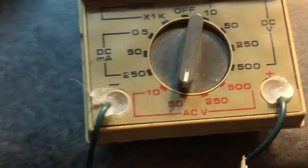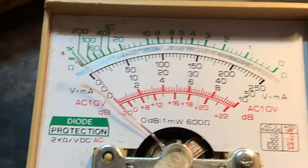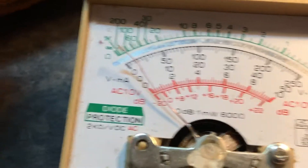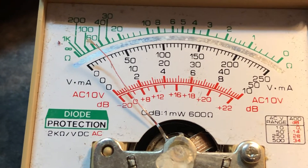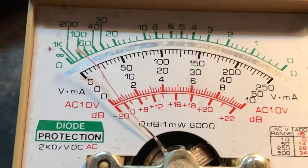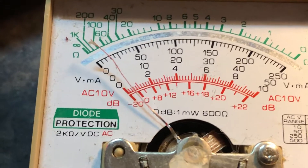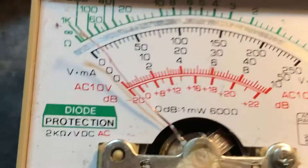That one is spinning real good and I got my voltmeter on this one. I set it to 50 AC volts and we're getting, well, nothing right now. It gets stuck sometimes because of the houses where the wind's coming from. Oh, there we go — it's gonna peak, it'll go up real fast. So we're at like 5 volts AC. And then the wind will gust — I've seen it go up to 30 volts AC out of this little stepper, but I never designed this thing to spin that fast.